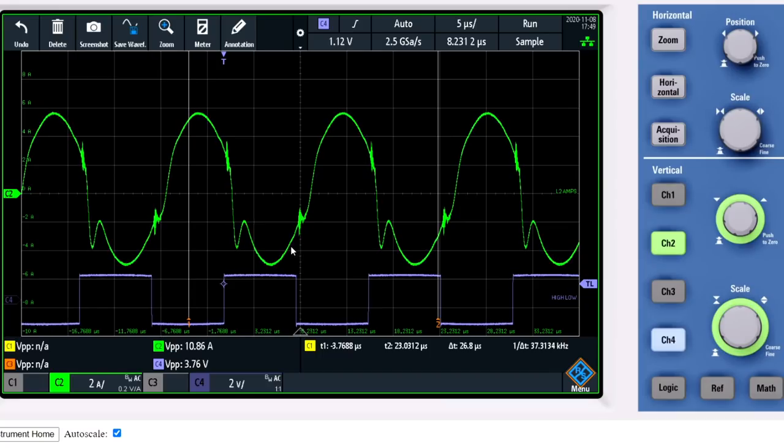This is very special because now the impulse is not charging up the capacitor anymore, but it is charging up the magnetic field of the coil. The impulse at the zero point of the current sine is amplifying the startup of the current. It starts up much faster, and that way it is amplified, because before we had 8.9 amps and now we have 10.8 amps, which is much more than we had before.